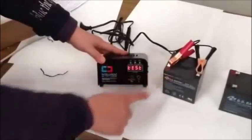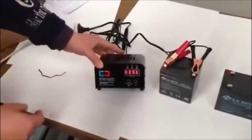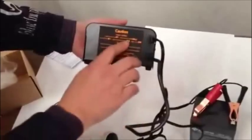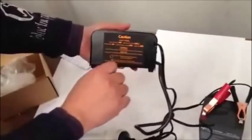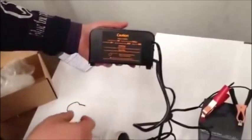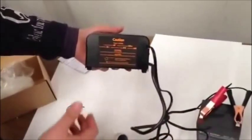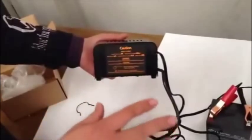If your battery is not fully charged, they will do it the other way. There are only 2 error codes shown: E5 and E3. E5 always means your battery has some problem. E3 is abnormal voltage. You may get E5 when charging an old battery if it has some fault — even a new battery showing E5 means something is definitely wrong inside.